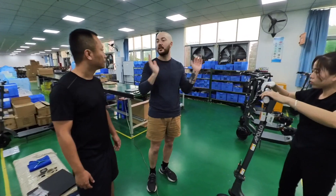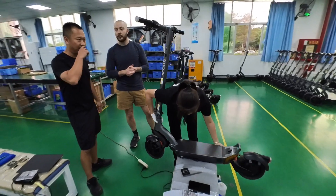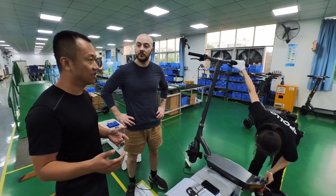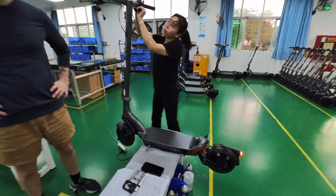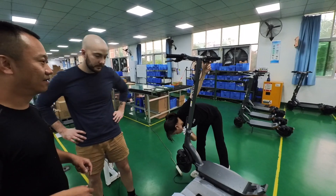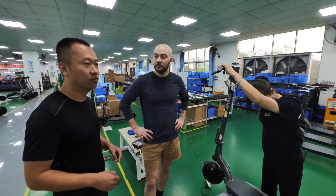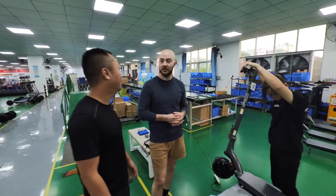When we say defects, there are different categories. The three main categories are: first, minor defects — cosmetic issues like scratches or small dents. Then major defects — bigger types of damage or function issues; we consider all function issues as major defects, like a light not working or a button switch. Finally, critical defects — anything that can cause a breakage or injury is considered critical. When we talk about the 30% or now the 1 to 3%, the main category is all minor defects.